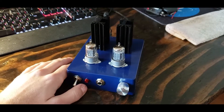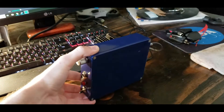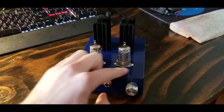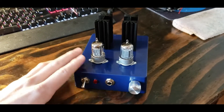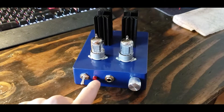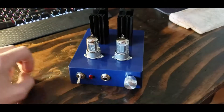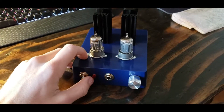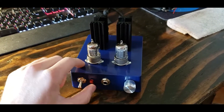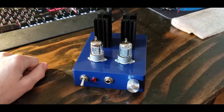I'm going to spare you from seeing the inside. This is a stomp box enclosure from Hammond, designed for guitar pedals — makes a nice little enclosure. It's got a durable blue coating that I thought looked very nice. I went completely retro on this — I did not use anything they would not have had in the 1960s. I used an aluminum knob instead of plastic, and an incandescent indicator rather than an LED. Everything is as period-accurate as possible. The blue kind of looks like blue Bakelite, which was exactly the goal.